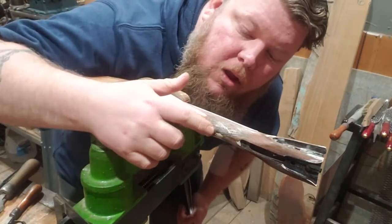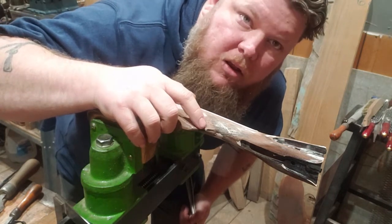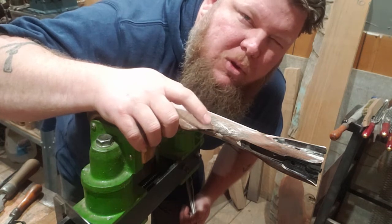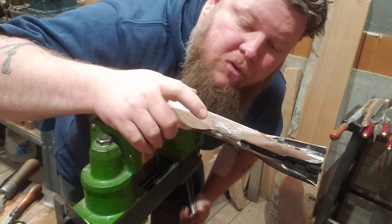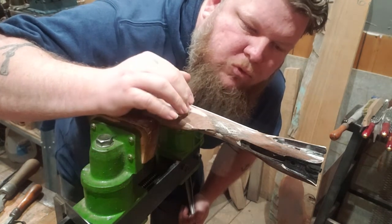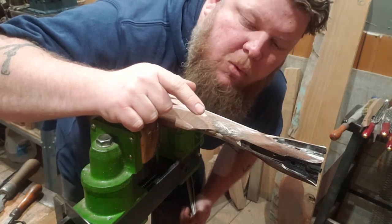At this point here this could be a lot sharper. I'm not going to take it all the way though, since this is going to be used as a pattern and it could be a little bit delicate. So to avoid this tearing out on the pantograph, I'll leave it a little heavy. So it just needs to be gone over just a little bit on the final product.